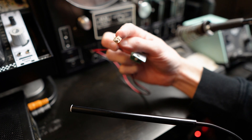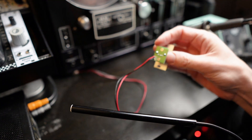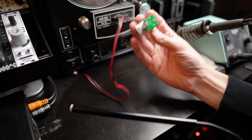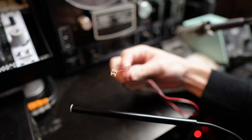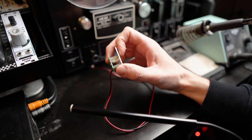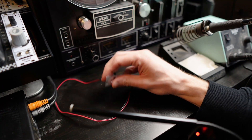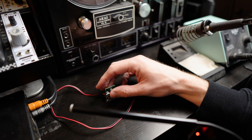It has this little two-pin plug for ground and 5 volts. I know that it's ground and 5 volts — besides knowing that USB runs at 5 volts — because they handily labeled the back: ground and 5 volts. Well, if I can figure out how to get my other cases, which don't have this connector, to give this thing 5 volts, I should be able to set it in my 1U row and have light, which would be really nice.